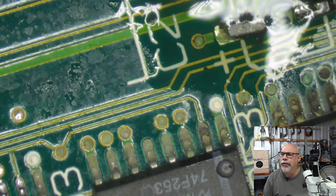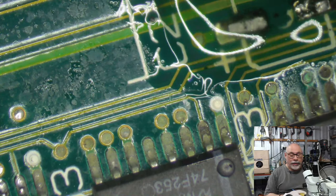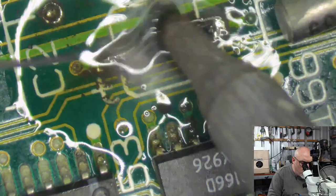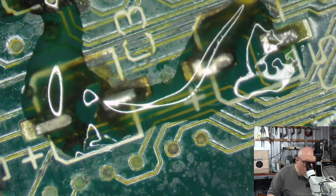Okay, so we know that the power supply is fine. The thing I basically say to anyone is, if you didn't think the caps looked that bad to start off with, it may not have been the caps in the first place, but I always check the recapping first. I always consider that's the most likely thing to have gone wrong because I am human. So when I'm doing recapping and something hasn't worked, I always like to check my recapping to see that I haven't stuffed up. If you're using tantalum caps to replace, they have those wider pins.